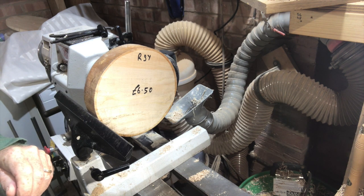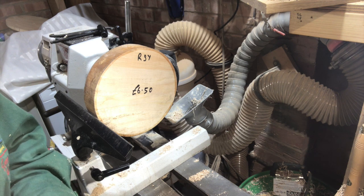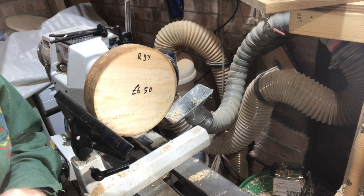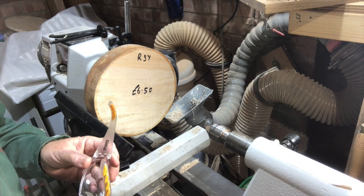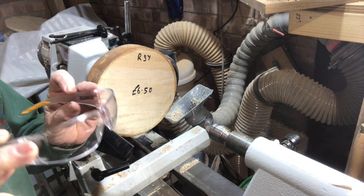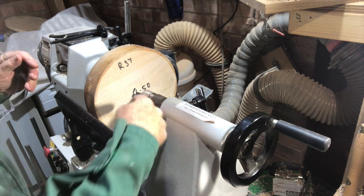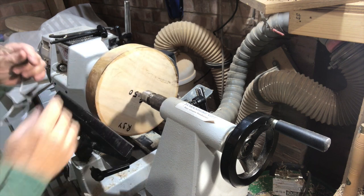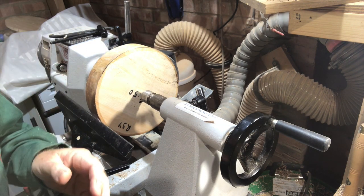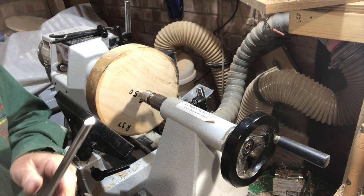What we're going to do first — I always say this — I'm just going to bring the tail stock up for added security. That's just a safety feature because at the end of the day we're all responsible for our own safety. Normally, 99% of the time, I always use an air shield which is a full face mask, but today I'm just going to use the minimum — a pair of safety goggles. We're going to bring up the tail stock and just wind it on for added security. We have to take that away when we're putting the foot on here, but to true this edge up I'm just going to wear a pair of goggles. This is for demonstration purposes only.